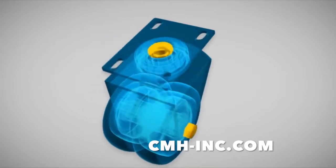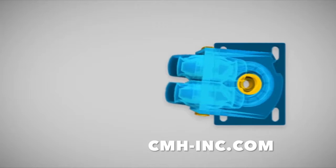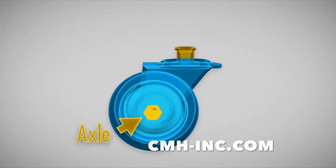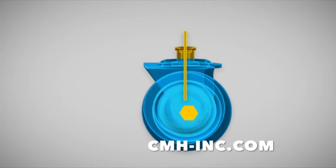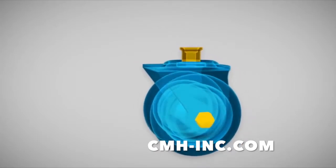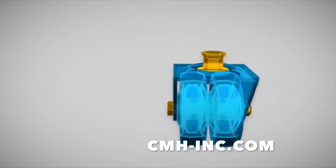Notice that on casters, the center pin on top, which is where everything pivots from, is not directly over the wheels. Like here's the axle of the wheels, and the center pin is way off, like this far. And if it was right on top, when you tried to change direction, it would just drag the wheels sideways. By having it back, it gives you the equivalent of a rake angle.